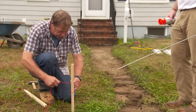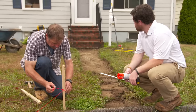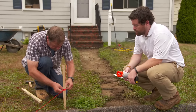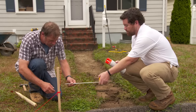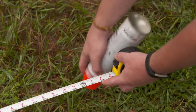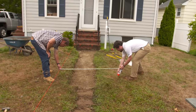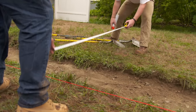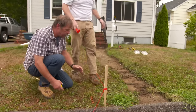I'm putting this string line up — this represents the edge of your walkway. We pulled it off the foundation. We want to get close so we know what to dig out and we don't want to dig out more than we have to. We have four foot six plus six inches, which is five feet. This string line represents one edge of the new bluestone walk, but we want the base to be larger than that — six inches out on each side, marked with orange spray paint. That's how far we have to excavate.